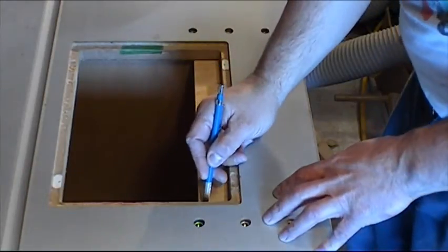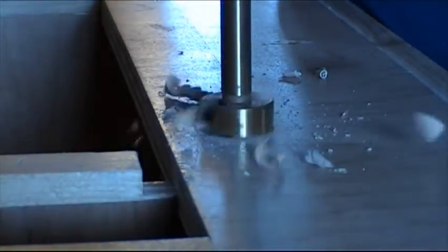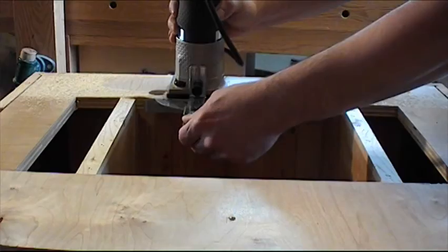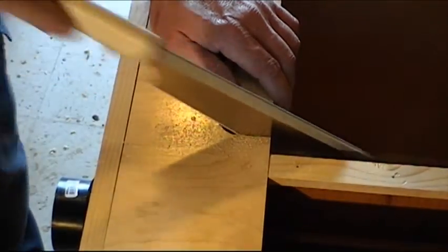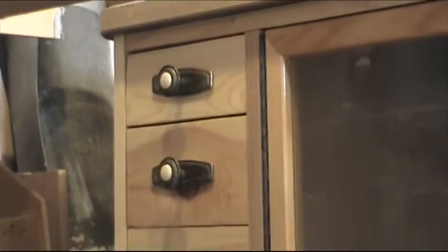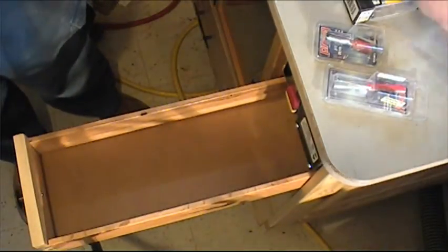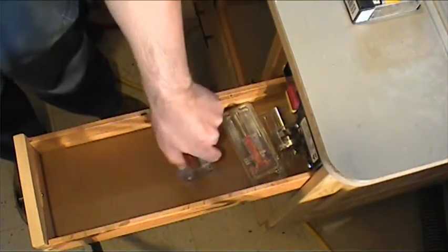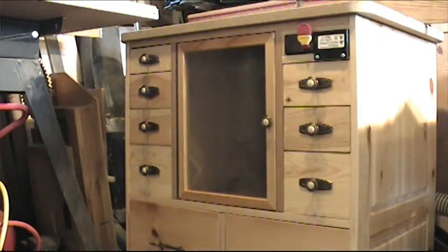Before fixing my old tabletop, I need to enlarge the top hole. I mark the hole and I drill two holes wider than the marks. I cut this hole with a router and a hand saw. Finally, I can screw the router table top. Here is my new router table cabinet — I just need to fill the drawers with router bits and other stuff. Thank you for watching and see you next time for another episode of the Woodpecker!